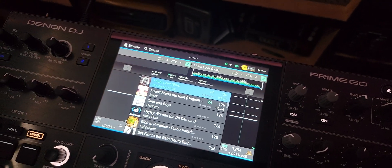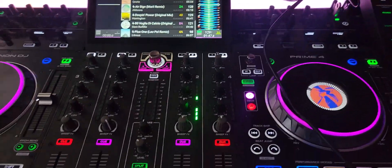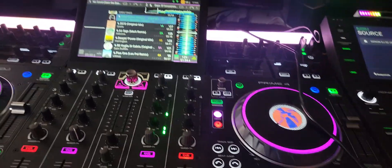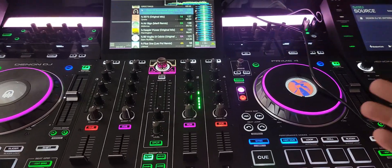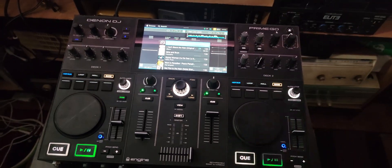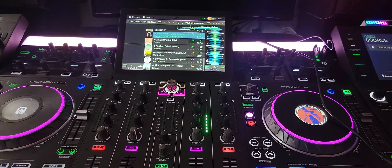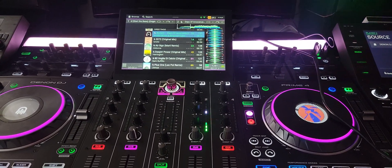I don't know what's not working for you. This isn't hooked up over a network — it's plugged in Ethernet straight into the back of the Prime 4. No fancy trickery. I've done this before with an MPC-1 and with the Akai Force over here. Akai stuff links over Ethernet and the Denon stuff obviously all works together. So you could do a Prime Go to another Prime Go to an SC6000 to a Prime 4 — it doesn't matter. And if you want to have them all together with no Wi-Fi, you would just use an Ethernet switch, and that works too.